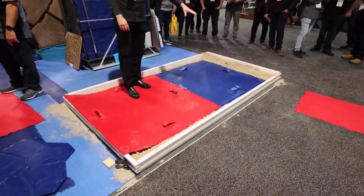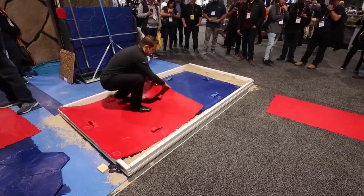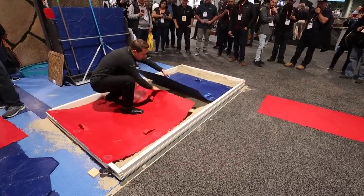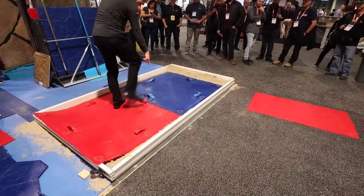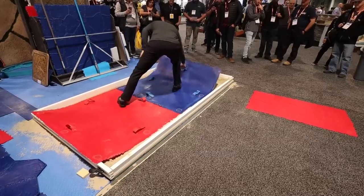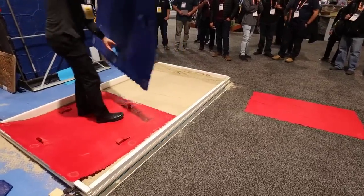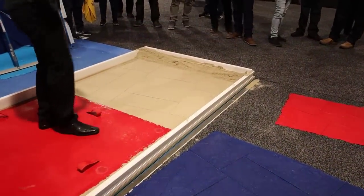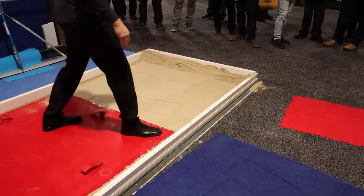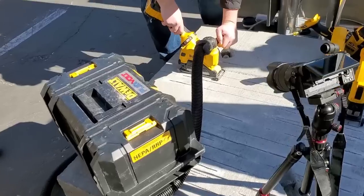And we've already stamped this first one, so before we remove it, we flip-flop these stamps like this so that we can blur out that edge right there. So I'm not going to step right there. I'm going to pull it back and pull it all the way back, lift it up, and then I don't want to step on that edge to press that edge into the concrete, but I just walk right along here, stamp.